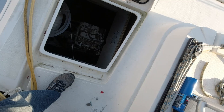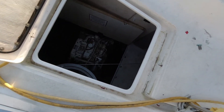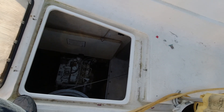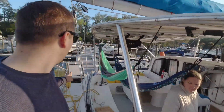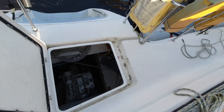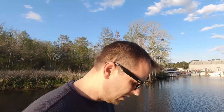It didn't turn over at all - it just clicked. The logical explanation is the battery is dying or dead. We're going to go ahead and start the starboard, because I'm thinking this port side engine battery is dead. When they were wired in originally they were all tied together, so it's very possible it's been bad for a long time and the other one was covering for it. We started the starboard - we've got water - and I'm going to flip my battery combine switch, which should effectively act like a jump.